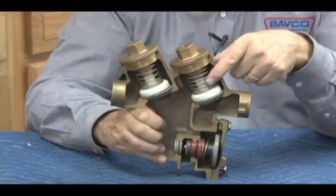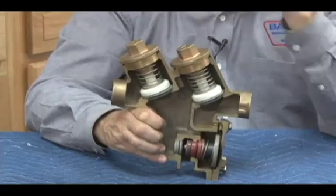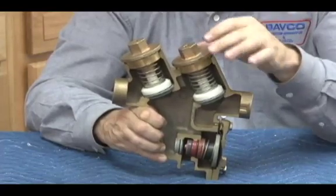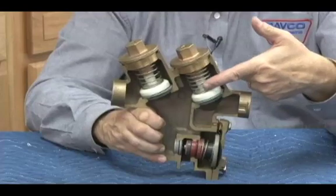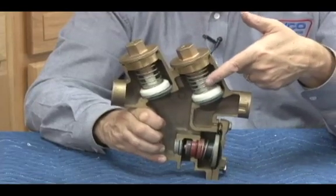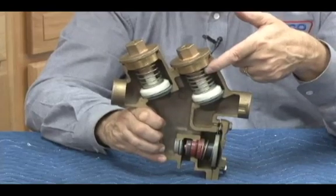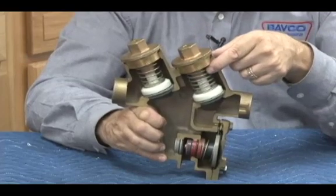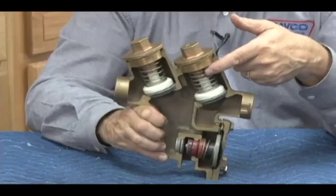But what happens if our check assemblies, our disc holders, first or second check, are swollen or having a lot of dirt and debris on them, or if they've been scratched because of sandpaper? And I open this test cock quickly to blow water out it. Could that suck that right into the top there? Sure, it could. What happens if I suck that cover, that disc holder all the way past that breather hole and I close that test cock? Is it possible that they could create a vacuum on that backside? Sure, possibly could, especially if anybody put grease on that check assembly right there.